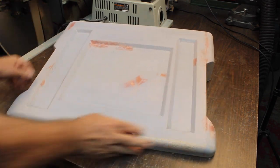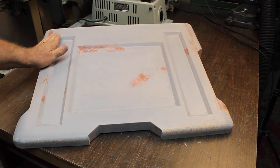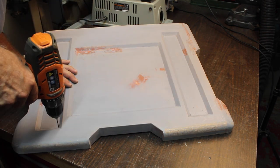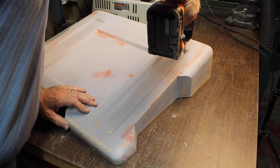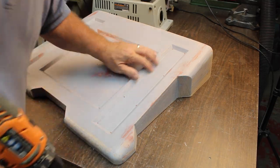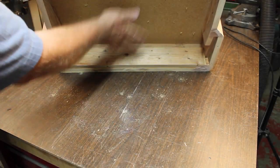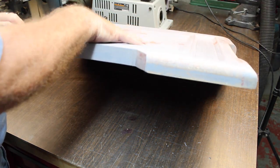One other thing we may have trouble with is these corners that the air is gonna just go over the top. It needs to be sucked down in these panels. So we need to make some relief holes in these corners and probably one in the middle here so that'll suck this down. We have all this air in here that we don't need. What we should do is fill this area up. That saves more air for sucking down against the plastic.